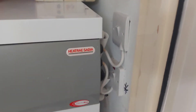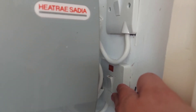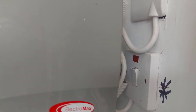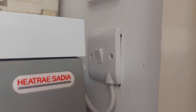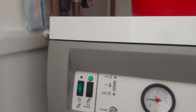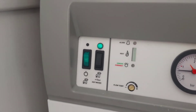These are the controls. This one here is turned on but the light is off, which means it runs on off-peak electricity because this property has an Economy 7 electric meter. The Economy 7 meter gives you cheaper electricity from 11:30 at night to 6:30 in the morning - seven hours depending on the clock on the meter. Then this one is the 24-hour supply which is a higher rate. To use peak rate electricity to make hot water we have to press this button here, which fires up the one-hour booster for the hot water.